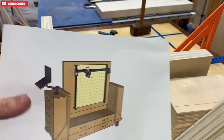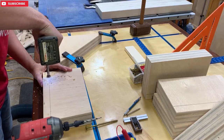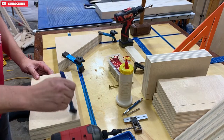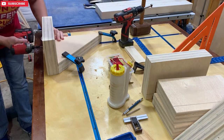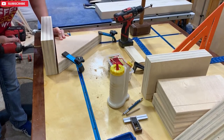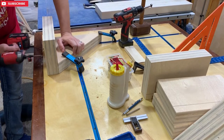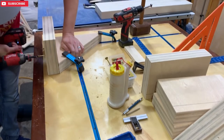We're about to begin assembling the angle bracket to the foot pad here. I'm using a Forstner bit to drill down just a little bit so that the head of the fasteners I'm going to use are below the surface of the wood. This will help with fitment issues — in this case the casters going on them. I also pre-drilled those and used my impact drill. A second person to help would really help, but do what you can.